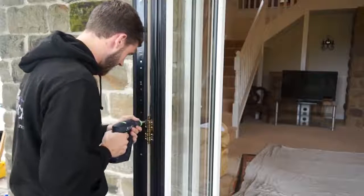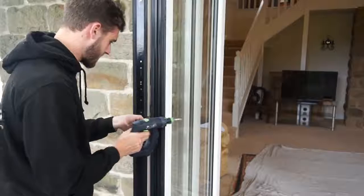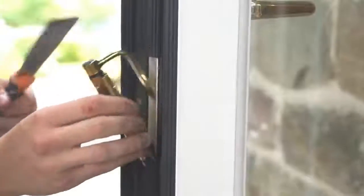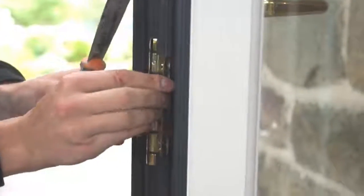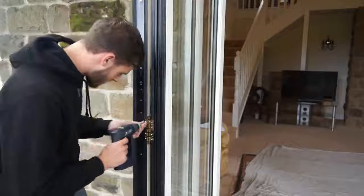Any vertical door gap adjustments needed can be carried out with the use of 1mm packers. You can remove or add these packers from each hinged point in order to give you plus or minus 1mm of adjustment where you need it. Remember to equally space these packers on the hinge and use no more than 3 in total per hinge.